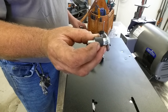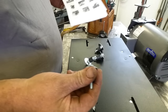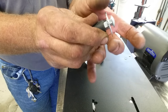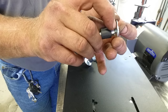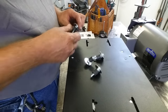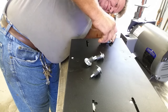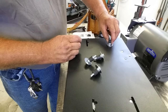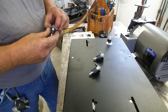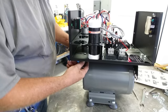We've got the vibration isolators assembled as shown in the picture. It's a carriage bolt with a square base, a fender washer, a lock nut with serrations facing towards the flat washer, and the vibration isolator bottomed out. You just hook it into the slot — look at that — and it lines up with the slot. Then you can tighten from underneath and the nut is captive so you don't have to go inside the panel with pliers. Pretty painless — it just dropped right on those holes.